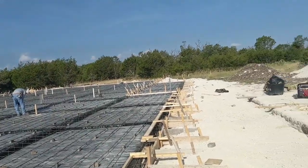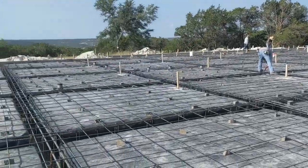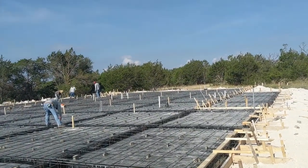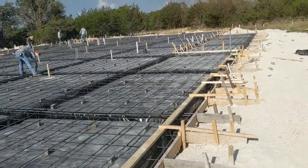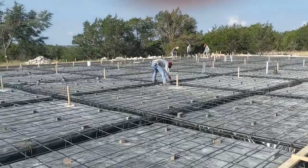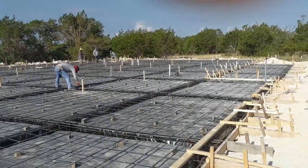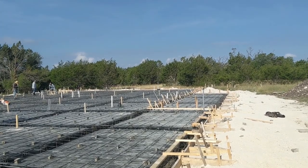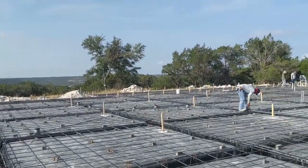The other thing I didn't mention in our previous videos is when we talked about the steel going in — it's down two, two and a half feet — and there are six beams in the outer perimeter. The concrete mixed guys with their trucks calculated that because of all these beams, there's about 250 yards of concrete going to be poured tomorrow. I thought it was closer to 150, but they're actually saying between 250 and 270 based upon these beams. So it's going to be a lot of concrete pouring.